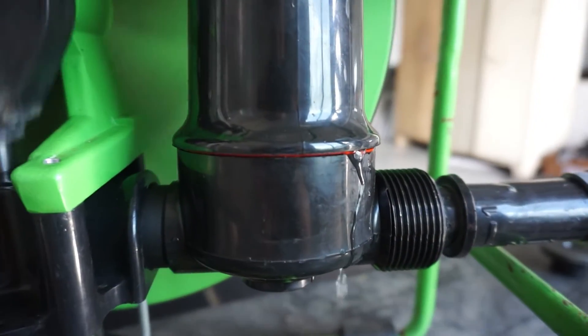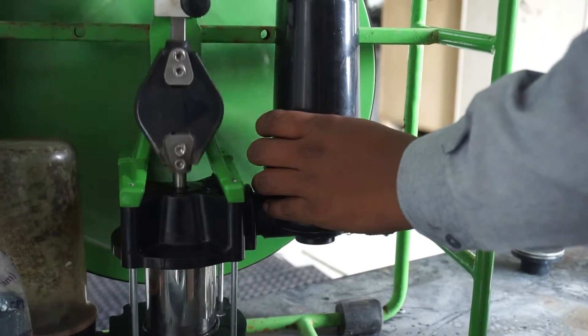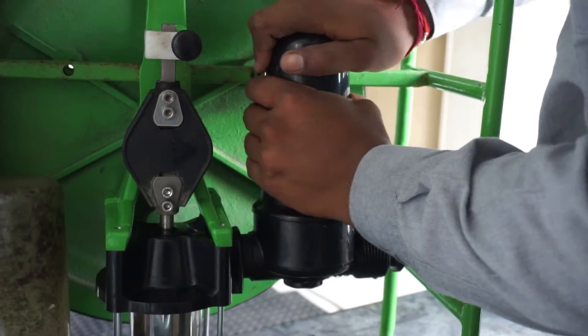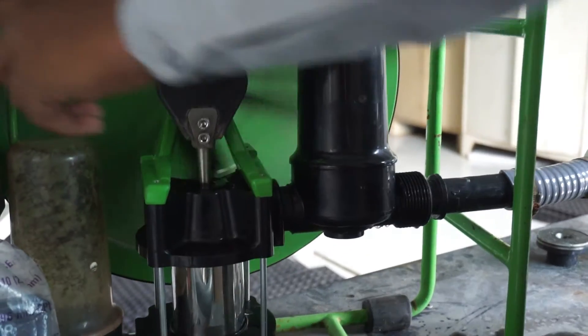If this is fine, check the air vessel by swapping the air vessels. If there was a leakage at the suction air vessel, it will now start pumping and show on the discharge side as water will be leaking out. Simply tighten the air vessel top or replace the o-ring if necessary.